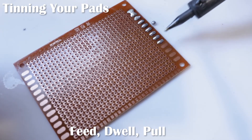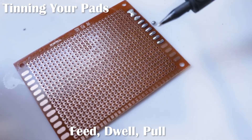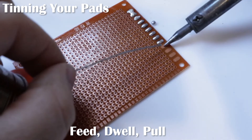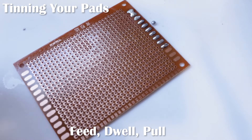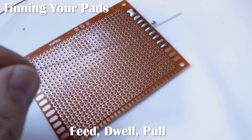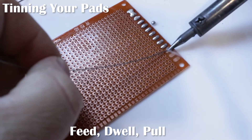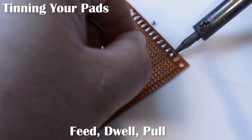Now if you don't wet to the edges, let it cool down for a second and then apply heat and move it around a bit. Between each solder joint I like to clean my tip. I'm going to switch it up to a half-mil — this is my workhorse. I pretty much do 99% of all my soldering with the lower gauge. It just feeds in nicely.